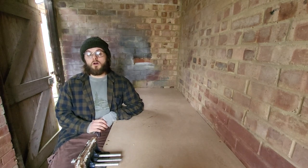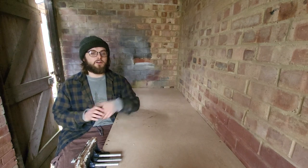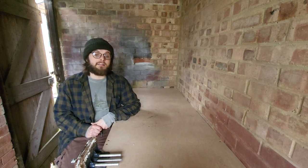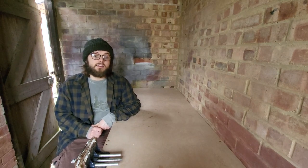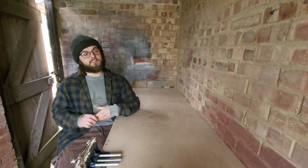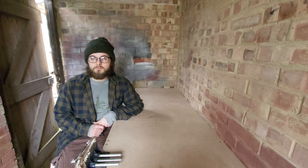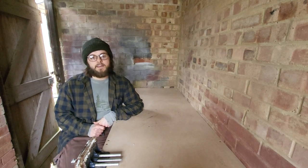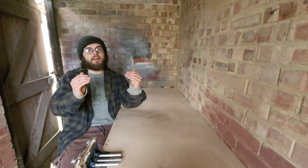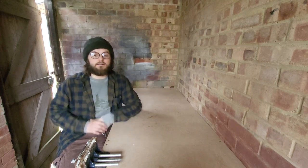I'd also like to go over why we use different radii. So why the top of the guitar is going to have a shallower radius and why the back is going to have a tighter radius. That's because, or I've seen online that people have claimed that the back tends to sink in over time for various reasons, because it's perhaps got less bracing on it. So with a tighter radius, that allows for the sinkage and it not to end up concave, so it's still convex or flat or whatever.